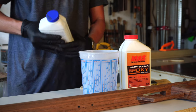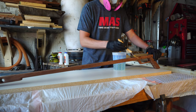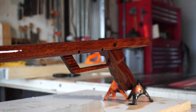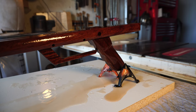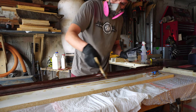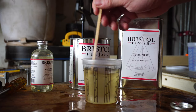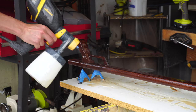For finish, Moss Epoxies was kind enough to send me out some product to try. I'm starting with penetrating epoxy to create an eggshell barrier that'll help the other layers of finish be applied evenly and seal out the wood from the elements. Now many spear guns are unfinished, however this rosewood was just too pretty to leave alone. With stage two, we're onto a two-to-one epoxy, which will give this gun another protective layer more substantial than the penetrating epoxy. And as a final top coat, I'm going with Bristol finish, a sprayable urethane top coat, which is an alternative to spar finish providing an additional layer of protection as well as an awesome silky sheen.